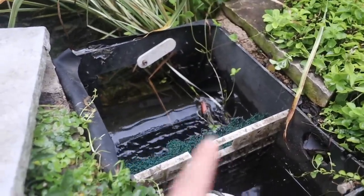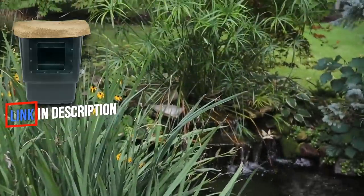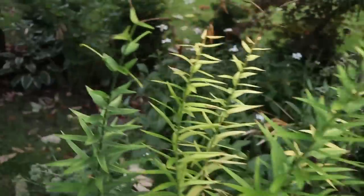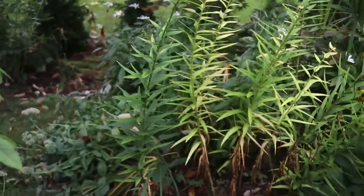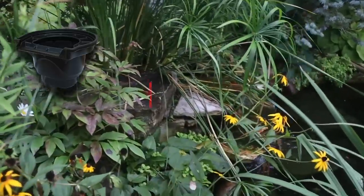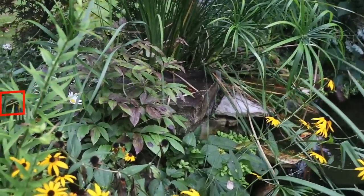So we're going to replace the skimmer with our new 1000 series skimmer. We have our waterfall sitting up over here — we'll pull all these plants out, add about five tons of 18 to 24 inch rock all around here, then tear out that waterfall and add a 2500 biofalls and a small meandering stream with a 10 by 15 piece of liner.